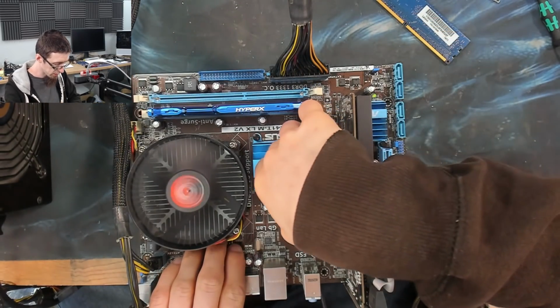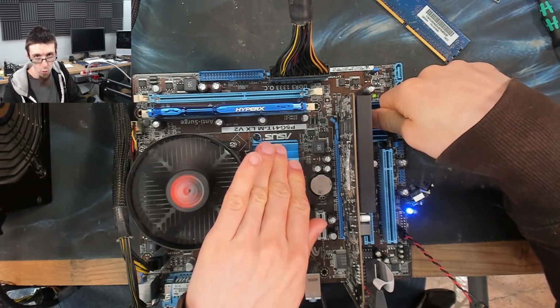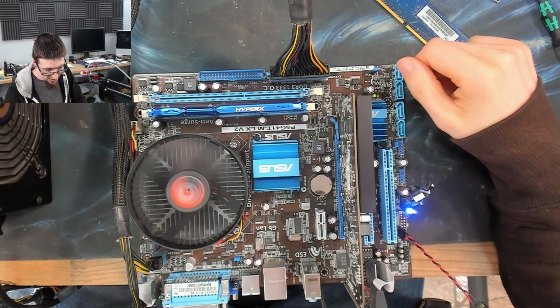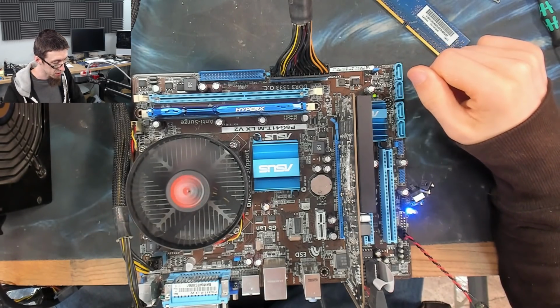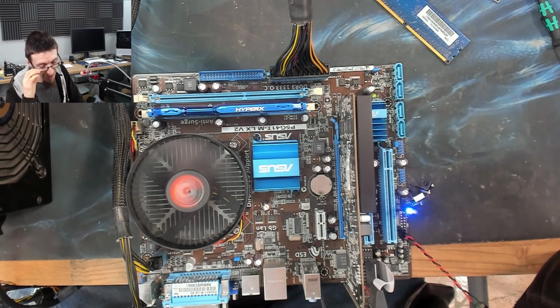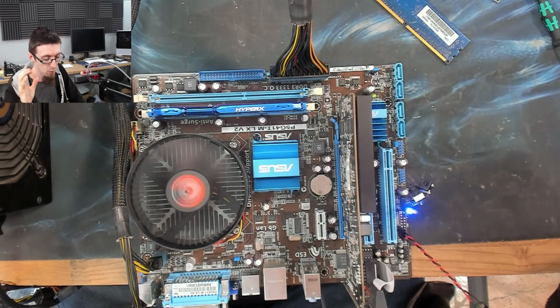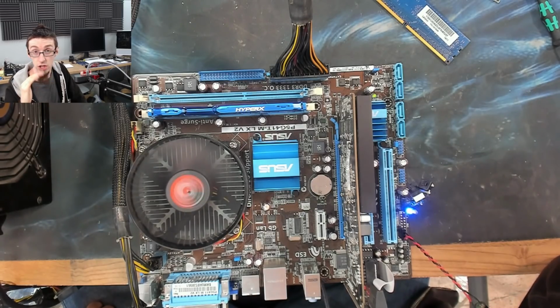There is some residual heat in the chipset heat sinks. They're not warm, but they're not room temp either. So the board is alive. It's doing something. I wonder whether I should flash the BIOS chip as well, just as one last thing. What I really don't want to happen is to discover that there was another fault with this board. And yes, the capacitors were all leaky and horrible, but they weren't actually causing a problem. Because I've seen computers with domed and leaking capacitors that are working just fine.